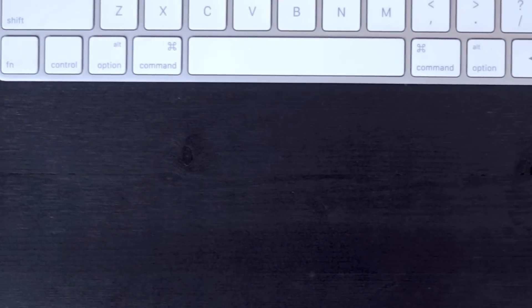Now some of you might be thinking, if you wipe the stain back off of course it's not going to set. Well, wiping stain back off is actually a popular way of staining — you stain and then wipe back off right away so you don't get as much absorbed. Another way is to stain the whole thing and just let it sit. My computer desk and filing cabinet have both been stained that way. I put a nice even coat of stain on and let them sit, then wiped back down. That's why I'm doing the test the way I'm doing it — so now let's go back to these two pieces and see what happens when you apply it to the burnt wood.